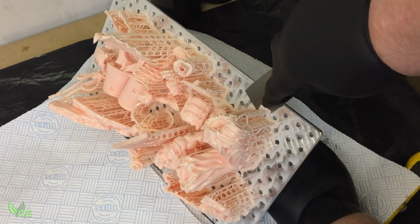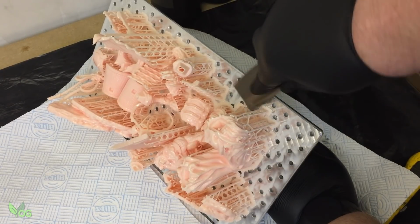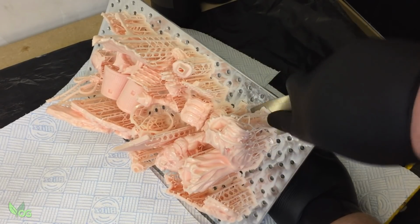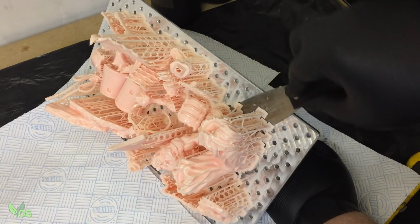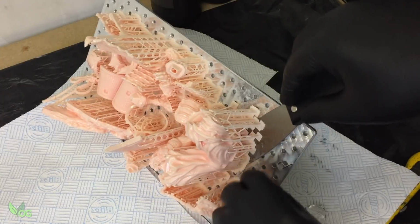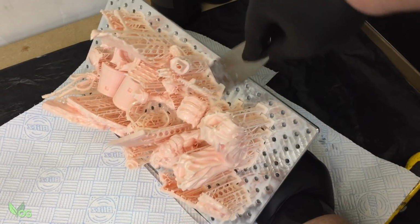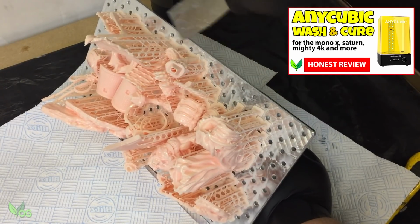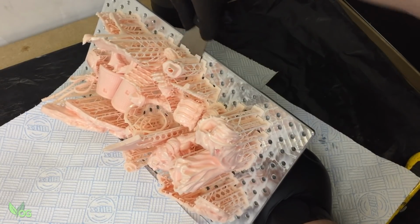This still took over 24 hours to print. Even though the layer exposure times are just 3 seconds, the speed of the Z-Rail meant everything took its sweet time. And when it was eventually finished, I was faced with a whole new set of challenges. The plate takes up a lot of room. I needed way more paper towels than normal, and even using the Anycubic Wash and Cure Plus to clean my prints, I had to clean the pieces in batches.